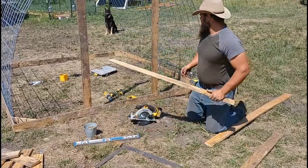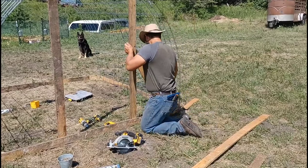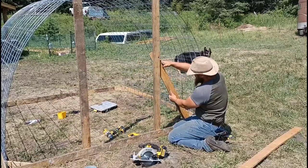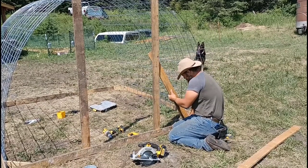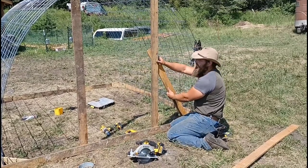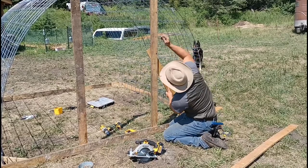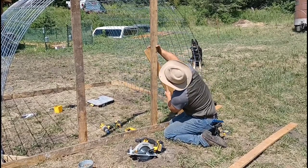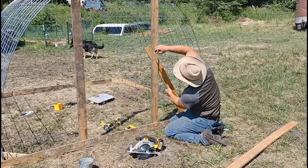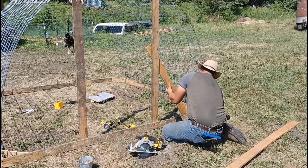So what I do at this point is I set my corner braces. So I take one. What I do is I set one and I kind of take a height. I want it to be in about the center of this board, give or take. And I bring it down till the tip of the board matches right at the top there. And I can feel under here when the tip matches there. And then I trace that bevel onto there. And I trace the bevel onto this bottom edge right here.